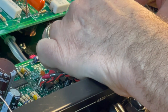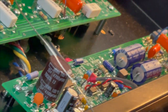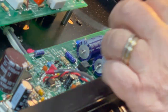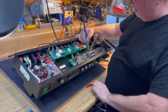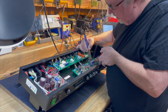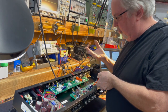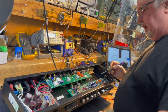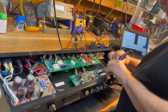Yeah. Some people like to design holes in the board that you can put tie wraps through to secure those. But I've found that this method is a lot more effective and long lasting because it doesn't stretch, it doesn't dry out, and it forms a little cushion under the capacitor that keeps it in position and won't allow it to vibrate loose.